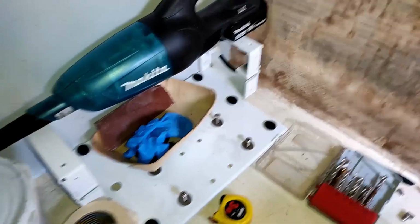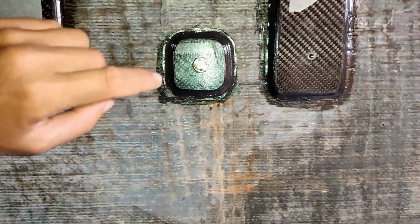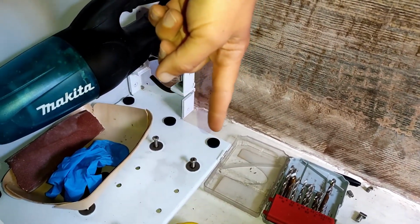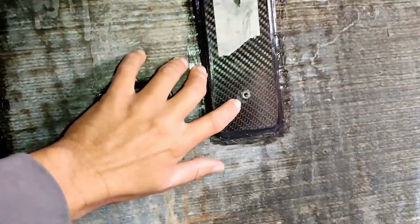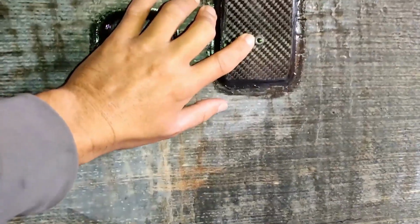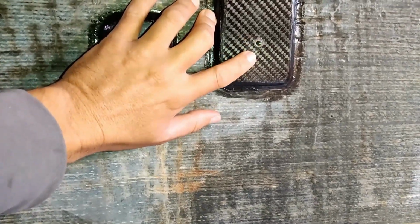The Watermaker bracket is under the vacuum cleaner and under all my rubbish there. What we're going to have a quick little look at is how I'm going to bolt that bracket there with not those screws, but screws just like it, through those rubber mounts there, there and there, to this carbon plate. I may or may not have mentioned the use of threads and helicoils, and I'm just going to give a quick explanation of what I'm using and why I'm using it.